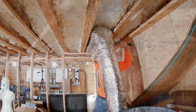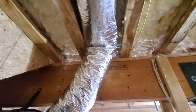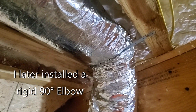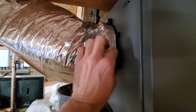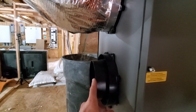I got my first ERV duct ran — this is the intake. I know you're not supposed to bend flex duct at 90 degrees like that, but I did check inside and it is open, so I'm not overly worried about it. I ran all the way down to that outside air vent. The only thing that was a little difficult was getting it hooked on directly onto the unit — they don't give you much of a flange to hook onto, it's only about an inch, so getting that taped up wasn't the easiest.